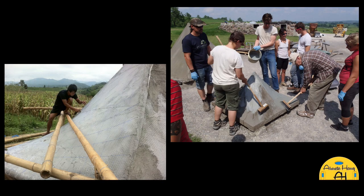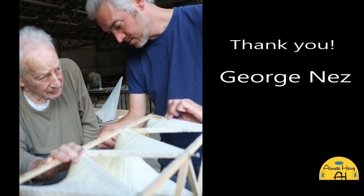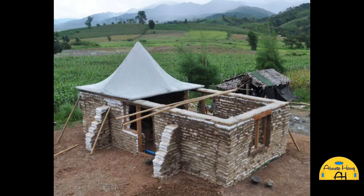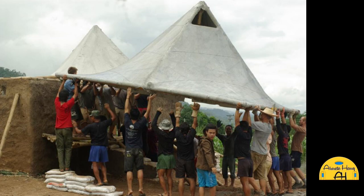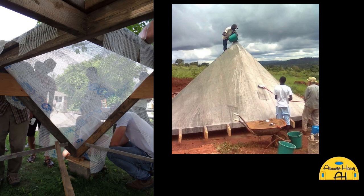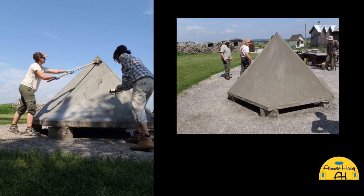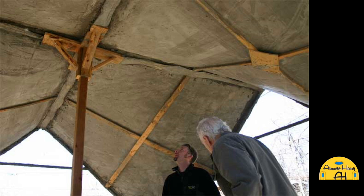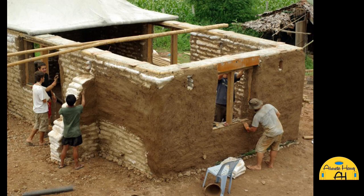We all stand on the shoulders of the great ones that came before us. And so I was standing on Nez's shoulder when I'm using his technique of mixing my own latex cement mix. Oh, I think I remember him. Yeah, he came out with the latex cement mix. And he would use fiberglass mesh, thin strips that he would put between wood beams in a hyperbolic paraboloid shape, and then he'd cover it with maybe a quarter inch or up to a half inch of his latex cement mix. And he had these solid roofs, and the locals would build whatever type of wall system they wanted.